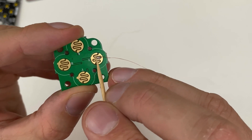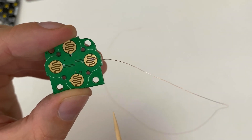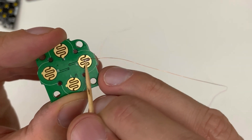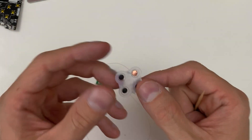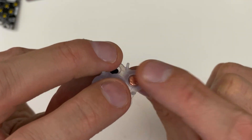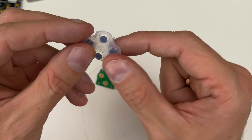So I split the pad — now I have one, two, and three contact pads there. I filed that down afterwards because there was a little bit too much variation in the height. And to help out with the button feel, I added a little bit of copper tape to the bottom of the pad. In my testing, that seems to feel just right. We'll see.